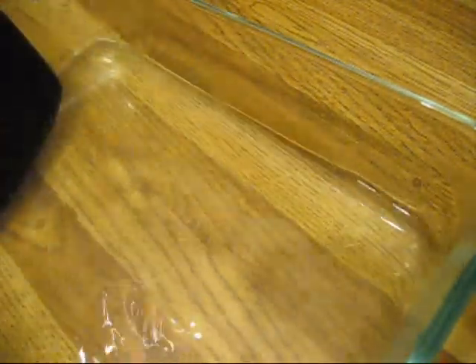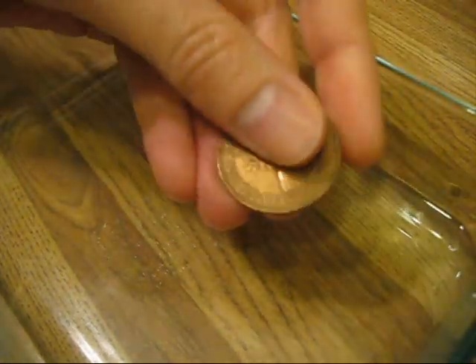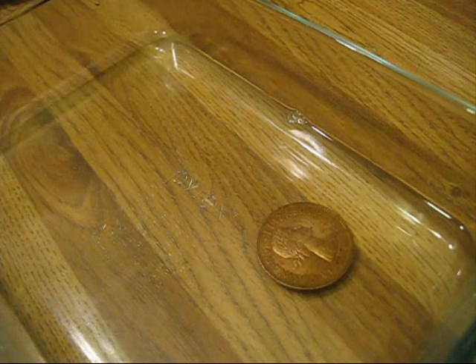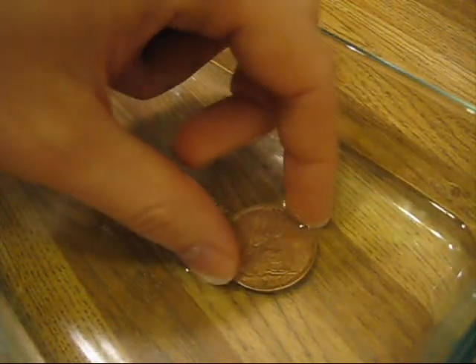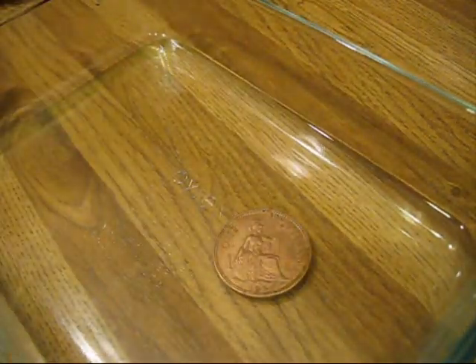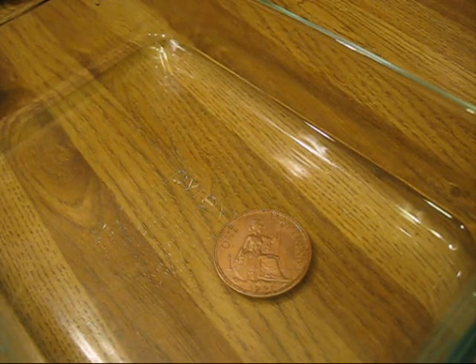Once you have no undissolved salt but it's as salty as you can possibly get it, then you're ready to go on to the next step. That looks to have finally just dissolved in there. Once you have that ready — which is technically a brine, an acidic brine — next all you need to do is drop in your copper items. So we'll do one at a time. You may be able to see it happen live on the camera. Yeah, you can already see that a lot of that patina is already coming off there, and this part of the process will loosen up the patina's hold on the surface of the copper.